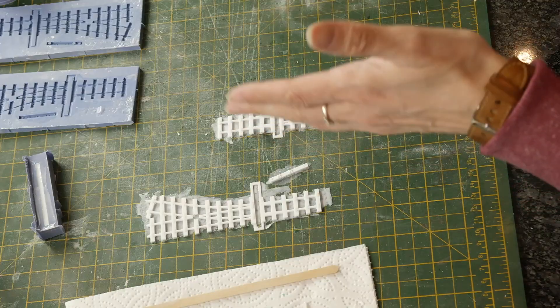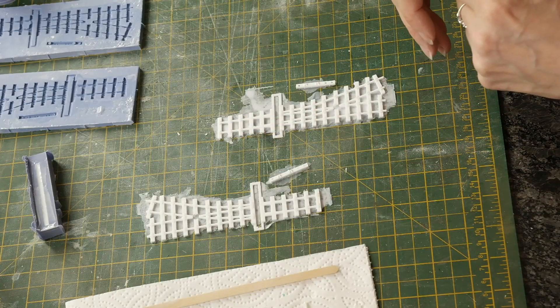So that's how you take a 3D design where you want to print multiple copies and cast it. The 3D print can be cast in a stronger resin than the 3D print allows, and you don't have to deal with layer lines every time. Whether you want to do something a hundred times or just need a stronger material, I hope you found that interesting. All of the materials and tools I've used are listed in the description below. Thank you to my patrons for supporting me — I really appreciate it. See you again soon.